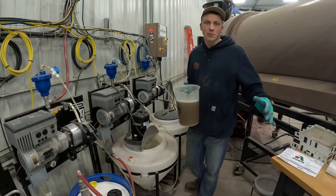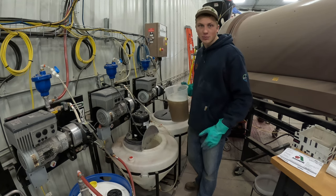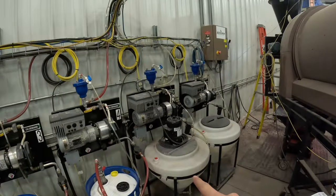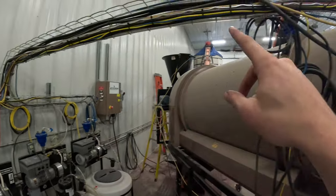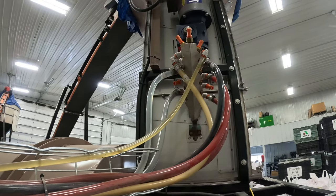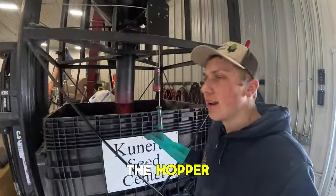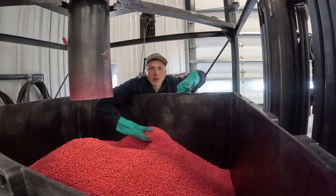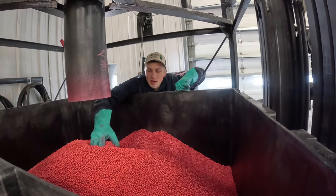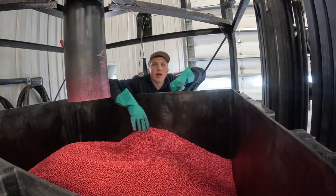Since the treater is connected to the internet, normally within 5-10 minutes of submitting the recipe it'll get approved and sent back. About 10 minutes later, I got my recipe approved by the chemist — it's all uploaded into the treater now. We're going to start filling one of these hopper tanks with our Heads Up soybean treatment. Now that I've got this hopper tank filled up, I'm jogging the line to make sure everything's primed up to the seed wheel. We ran that first bag with the Heads Up — I was a little worried about clumping from so much chemical, so I upped the rate of seed polymer. No clumps at all, so we'll keep with this rate on the next couple of bags.